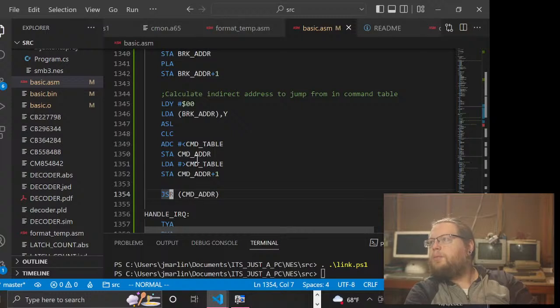Wareroom says, A is your bit pattern. It gets ANDed with the specified memory location, and the flags are set, so the memory location is not changed. Right, but there's no way to... It's a fixed memory location. It's not relative. It's whatever the operand specifies after the command byte. So I can't tell it to look up the stack, the location of the stack pointer.